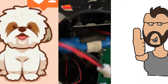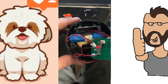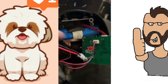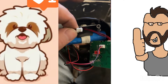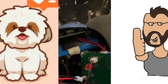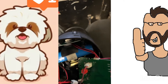Looking down at the board, you can see there's some corrosion on that button, and even after drying up, the buttons are still pressing themselves. We disconnected the battery — it's clearly labeled and just pulls right out and clips back in. With any electronics, always disconnect the battery. We've got a couple of Phillips head screws right there and there. We're going to take this board out, clean it up, and look for bullseye or melted spots.